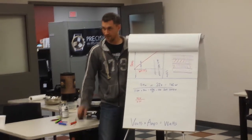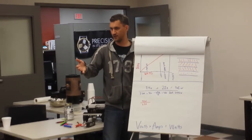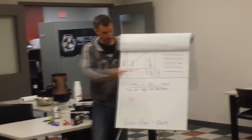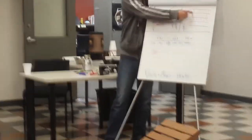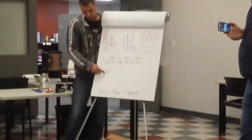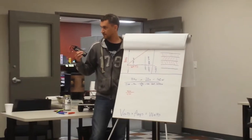And when these have LiPo fires in a car that's driving down the road, you wonder how that could happen. It wasn't even damaged or poked or anything. That's what happens. This decay accelerates really fast below 3.3, to the point where they can get so hot that they self-ignite. That's the reason you see LiPo fires. It's not from bad care or anything like that.